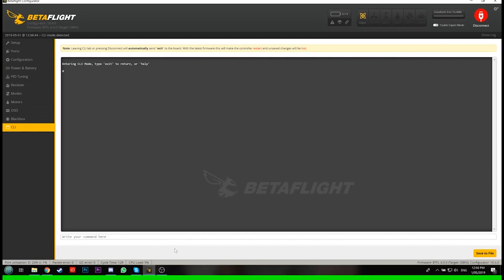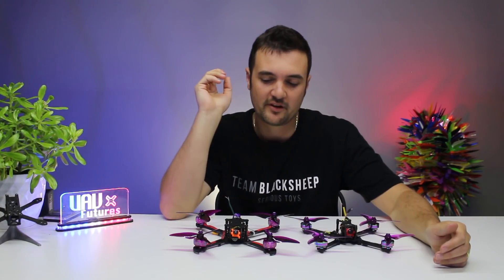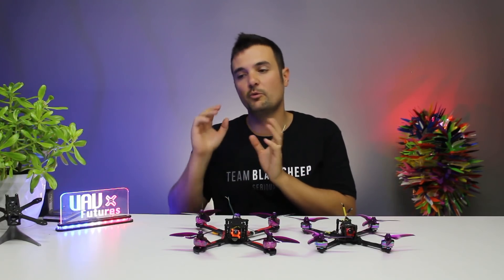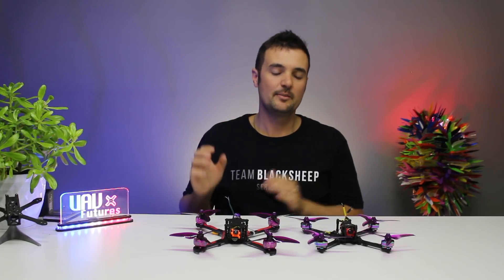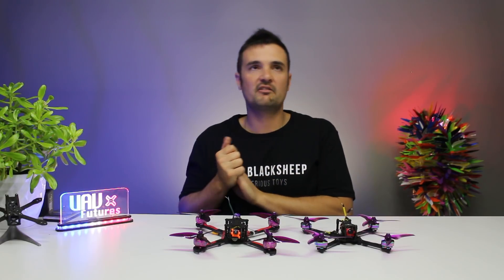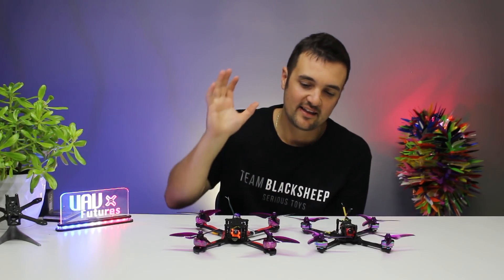When we type in 'version' we're now rocking Betaflight version 4 — pretty exciting stuff. So there's my quick little guide on how to update Betaflight. Don't be afraid of plugging into your computer and clicking that update button. Just take note of what version you're on by typing 'version', and take screenshots of your settings. I don't recommend doing a full dump because some PIDs and filters can change. Just note your motor orientation, ESCs, serial RX, smart audio, how your modes are set up, and your channel mapping.